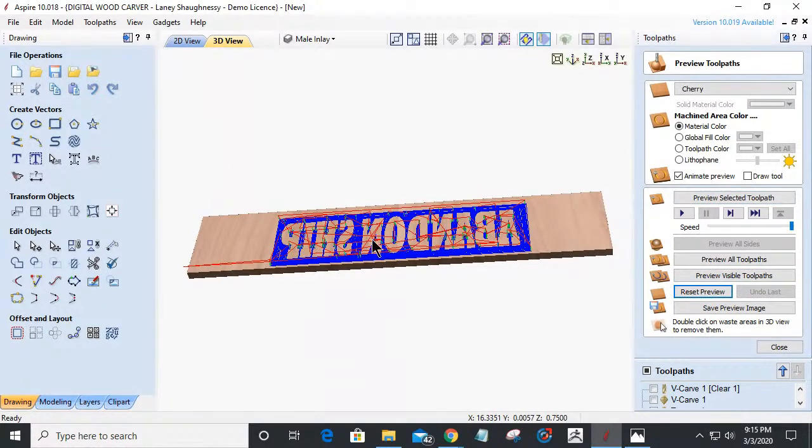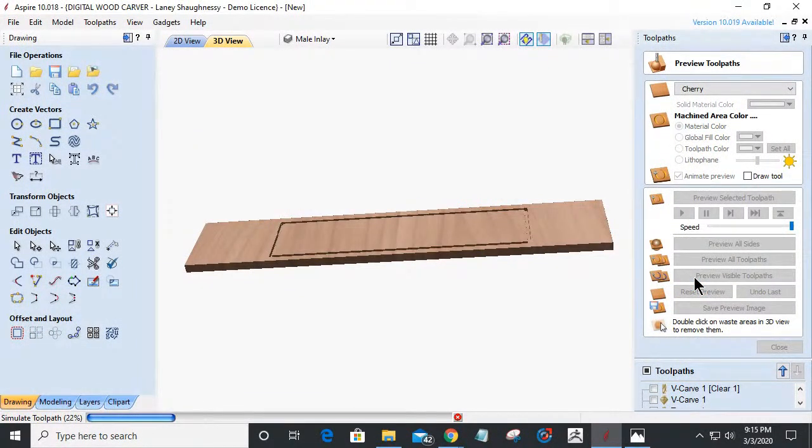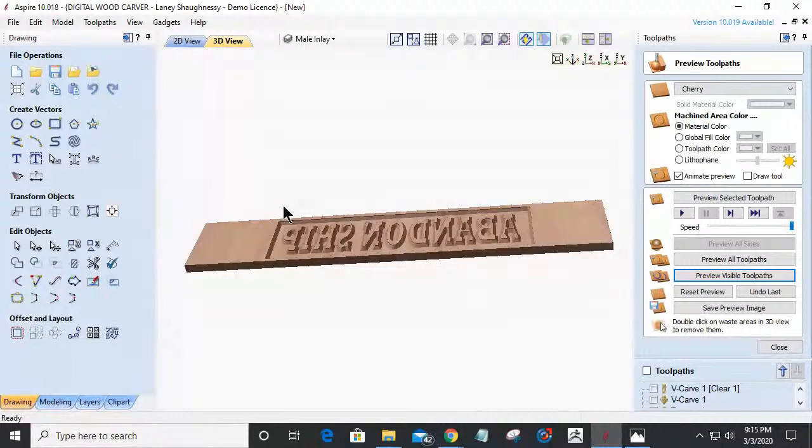That is going to create, out of a contrasting square little board or something, this raised male version. Going to take that over to the bandsaw, cut off these excess edges and everything so I can fit that and glue that into my female. Now, once that's glued in, then I'm going to take it back to the table, and I'm literally going to mill that surface down until I'm flush with my original board. I'm not going to cut too deep, and that'd be a pocket toolpath.